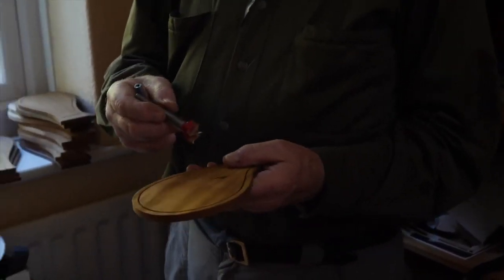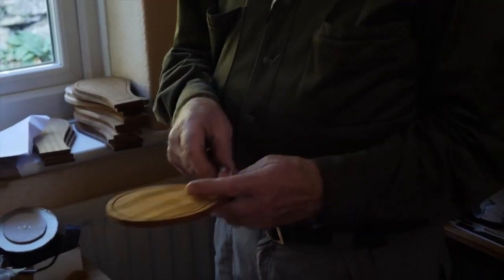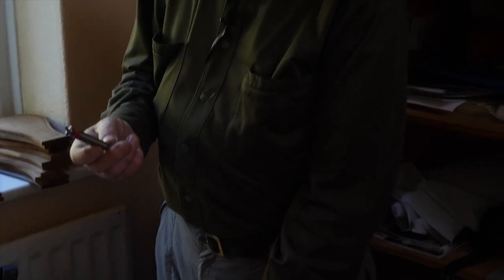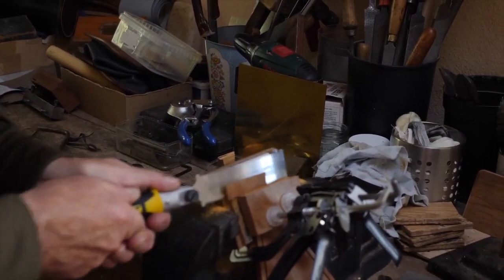So what size holes do you drill, Tom? The inlet hole, the large hole, is 25 millimetres, and the outlet hole, where the outlet fitting goes, is 15 millimetres. Okay. And these are tungsten carbide cutters, and they've been very, very good to use actually. They come in all sorts of different configurations. Have you used them at all? Yep, they're great. Really, really good. Yep, it's good enough.